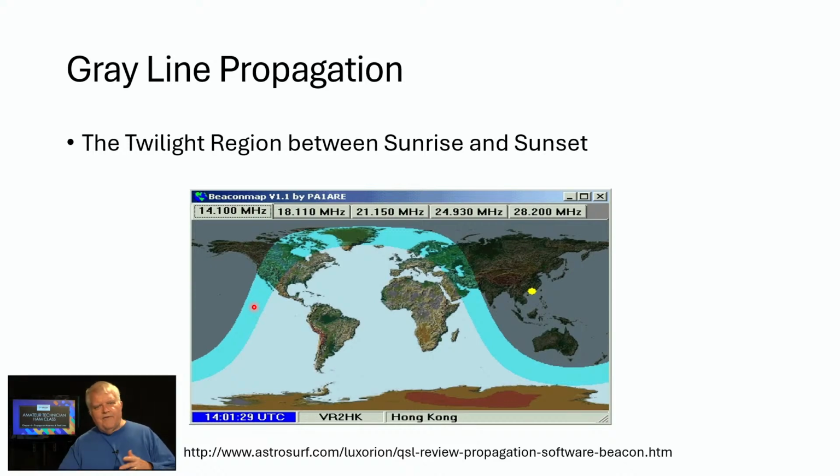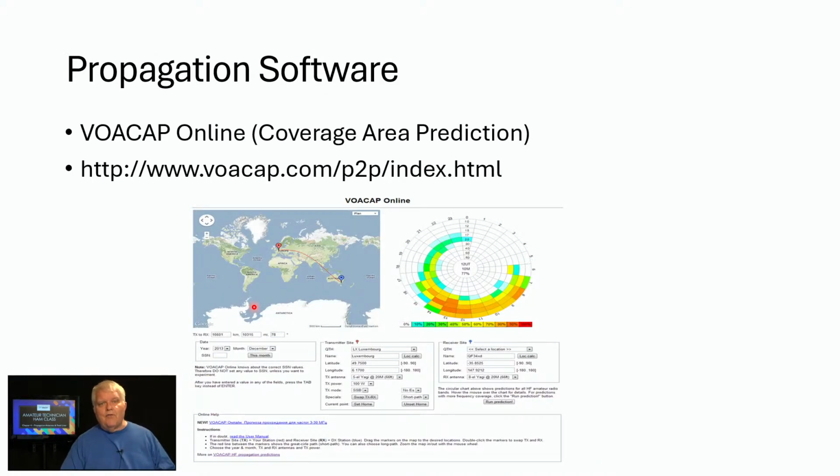Well, Gary, how do I know the MUF and the LUF and all that other stuff? Again, your taxpayers' dollars at work and the VOA to the rescue. The Voice of America Coverage Area Prediction Program, VOACAP, is available online at this URL. You can put in the information about your station, your antenna, your power level, and where you want to communicate to. Let's say Tuvalu in the Southern Pacific. You put in their specifications, and it'll give you this rosette, which is actually a clock face, that shows you that these bands in red and these times are the best time that you would have to communicate between, in my case, South Carolina and Tuvalu.